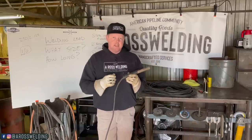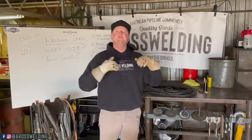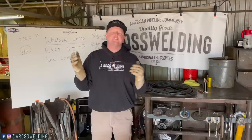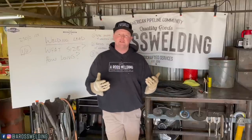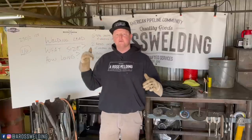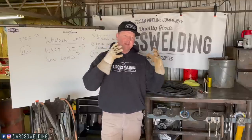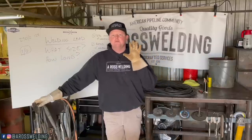Connection is a huge deal when it comes to welding. A clean and good connection is key to a good weld. Whenever you're welding on x-ray pipe, it becomes an even bigger deal versus welding on a barn where as long as it's melted together it's just fine. But when you're trying to make an x-ray weld on heavy wall pipe and making several passes, if you start to get a lack of connection anywhere in your welding lead, that could affect your weld and potentially cause a bad weld or bust x-ray. So whenever I was pipelining, it was a real big deal to focus on connection.